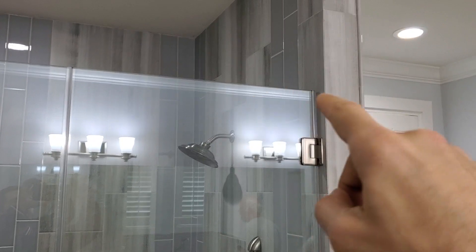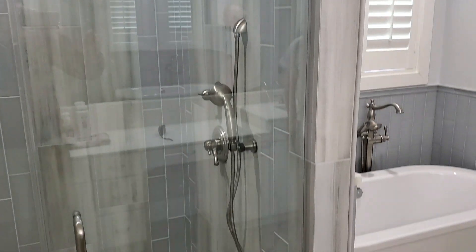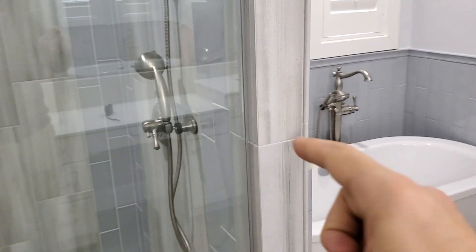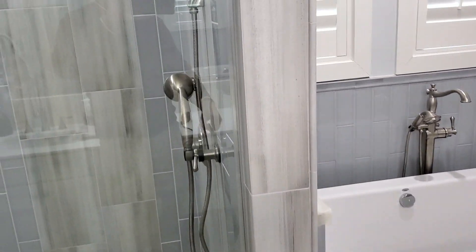Incidentally, the old tile came partly around this wall, so we went ahead and replaced the tile along this wall. And here at this corner we made a miter cut — that's where we take the two edges of the tile, do 45-degree miter cuts along there and then grout in between the two. That's so that we didn't have a row of pencil tile here and there. Right now as it stands, we just have the pencil tile.